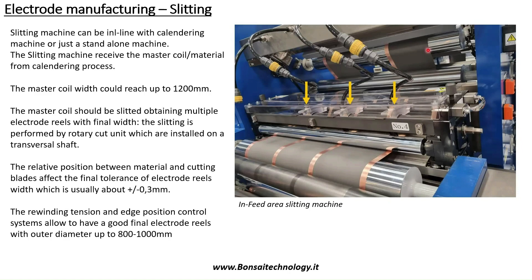In the case of a laser cutting unit, the limitation comes from the laser power and the type of laser. So there is no advantage in moving to laser technology, and all slitting machine makers are using shear cutting blades.